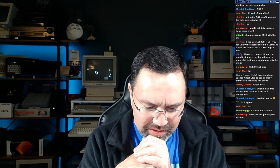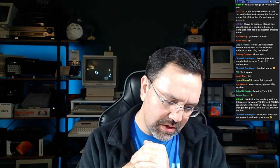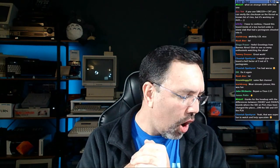What else did we learn today? There's definitely something else that someone pointed out that was very important that I did not know. Even TJ didn't know. What was it that you didn't know, TJ? Something about the 10x and 1x, make sure your 10x and 1x probe on the scope is correct. We learned that today. That's why the signals look so tiny when they weren't. So yeah, we learned a whole bunch of stuff and more. So yeah, we'll have to do it again.